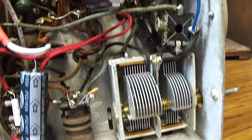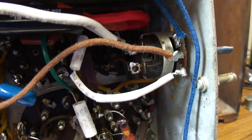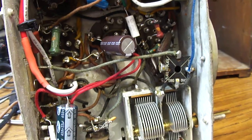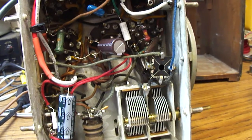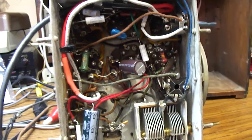Another thing about this is that the volume control was originally in the antenna circuit, kind of like the old TRF radios. At this time they hadn't really standardized on the circuits of superheterodyne radios as much as they were a little bit later, and so a lot of these early superheterodynes from the mid-30s used circuits more like the TRF sets.